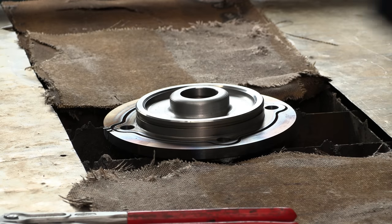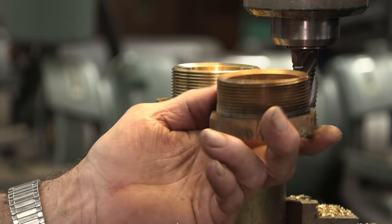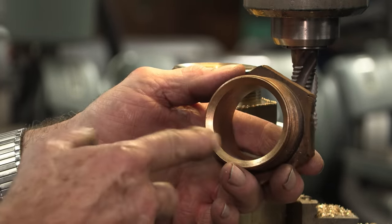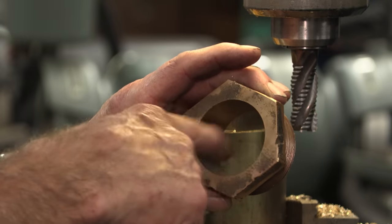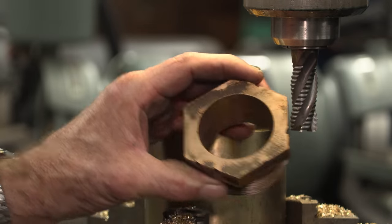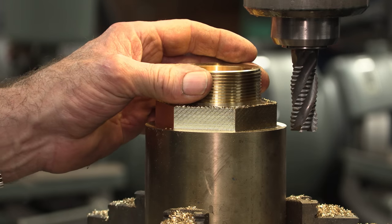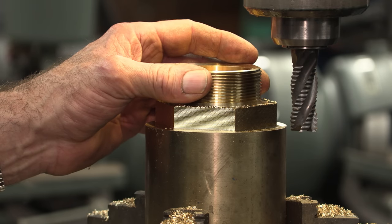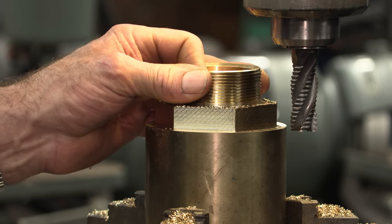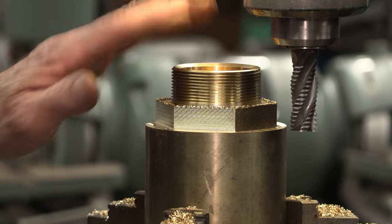All right. We just made our new packing nut. This packing nut was good, and it fits in and everything else, but the bore is opened up in an egg shape, about 30 thousandths. It is what guides that shaft, and you want that shaft to guide fairly centerline, and the tighter it is, without being too tight to bind, the tighter this bore is, the better the packing is going to seal.